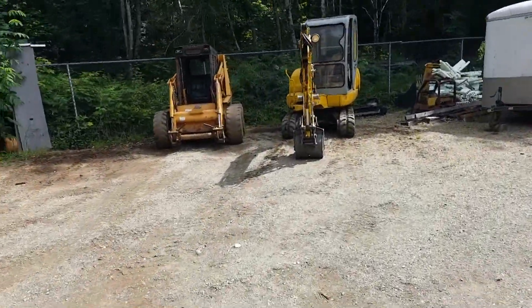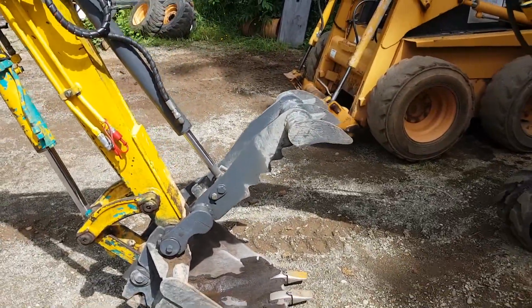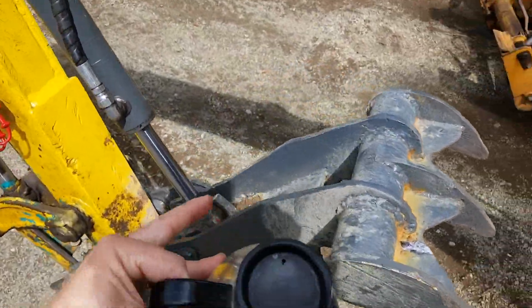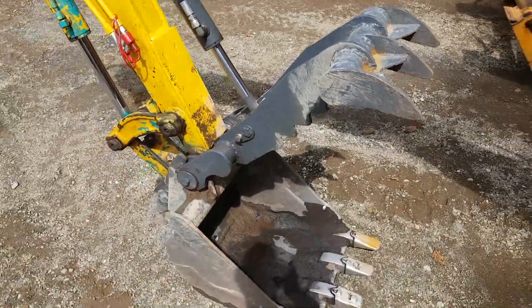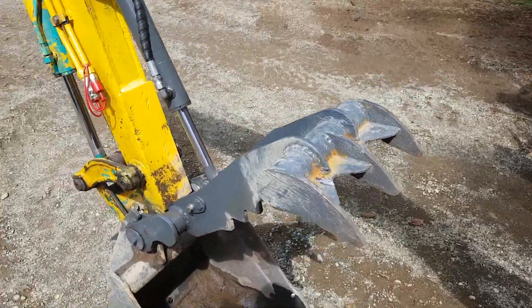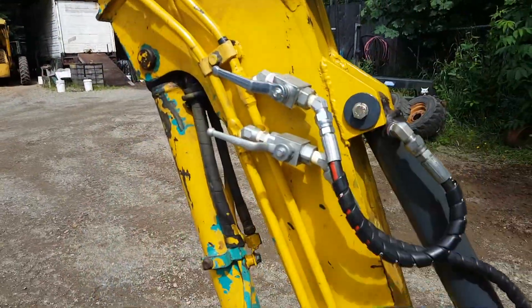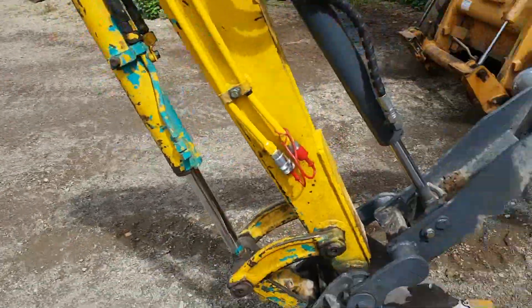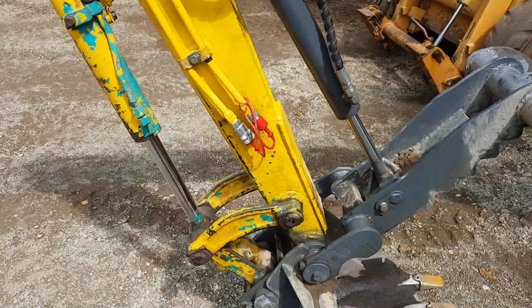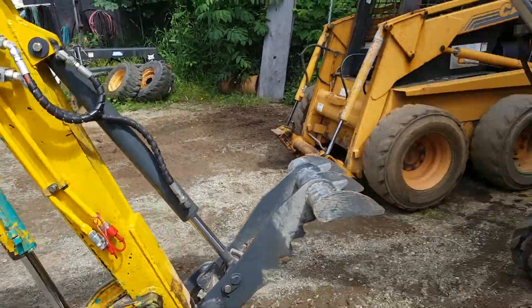The thumb is all done too - really like how it turned out. The tube-across-with-tines design keeps the section really narrow so it doesn't obscure visibility when not in use - a big difference compared to my 200 which is full width all the way out. For the hydraulics, I went with valves: put the thumb in the fully upright position, close off the valves, it locks in place, and all hydraulic flow goes through the quick couplers to the twist wrist. Saves a lot of juggling and flipping lines around.